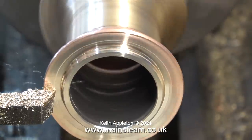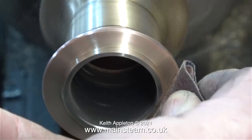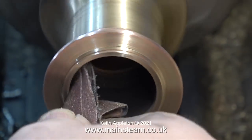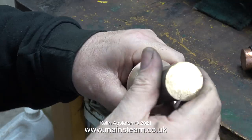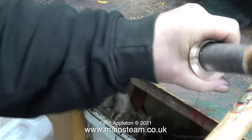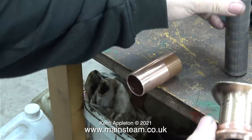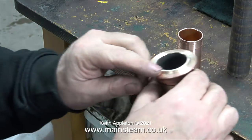Now it's time to carefully clean up the damage to the top cap. At first I thought the top cap of the chimney was made from copper — what I couldn't figure out was how the builder had managed to fit a copper top to the chimney where the join was invisible, but then the penny dropped. The top cap has been copper plated quite thickly, and so the damaged part didn't really get much better because I was halfway through the copper coating. To remove the mandrel from inside the chimney I used a piece of phosphor bronze bar slightly smaller than the diameter of the chimney and a heavy copper-faced hammer. At all times I held the chimney casting firmly in my hand and in no time at all it was removed completely undamaged.